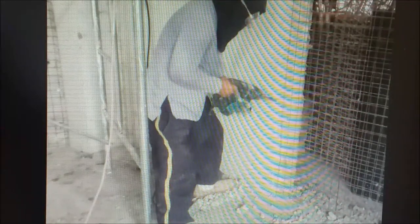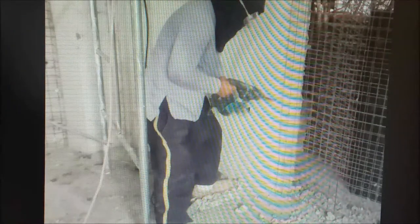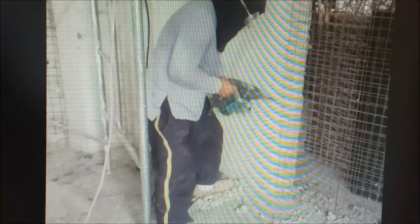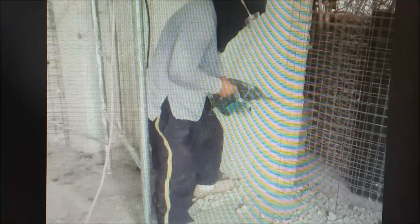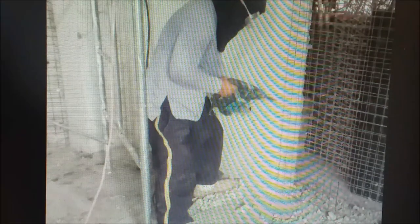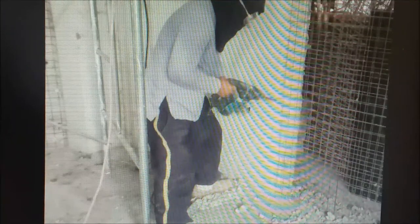He's chiseling off concrete to a line near where he wants it — probably just a little bit more than the door jamb — so they can come back with render after all the nails and wire. When we do the rendering, the two-inch mesh goes over the entire surface of the wall. If you try to start and stop it at all the door openings, it's hard to keep it laying flat. So we wrap it across the entire wall, render it, then come back and cut it out. The pieces we cut out get used on things like helical stairs.